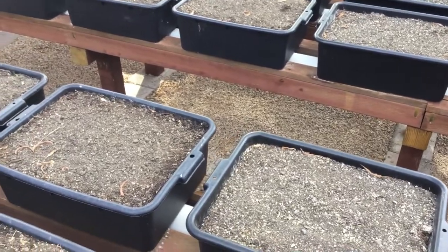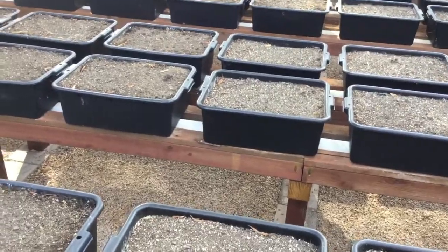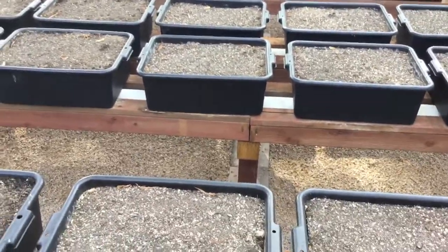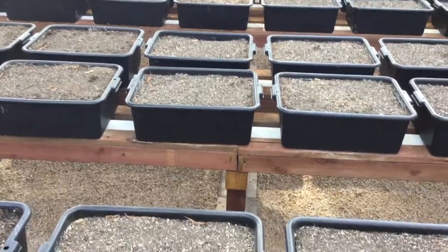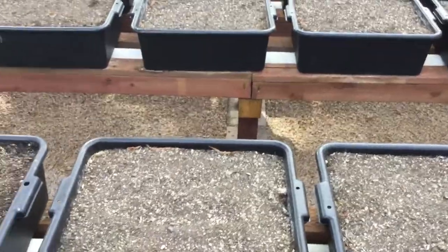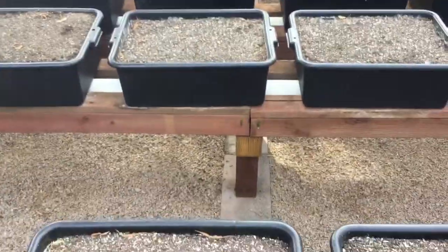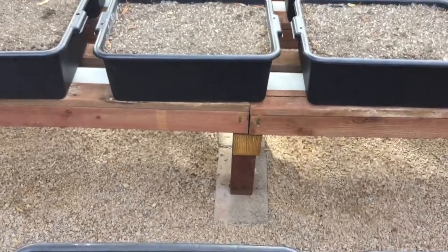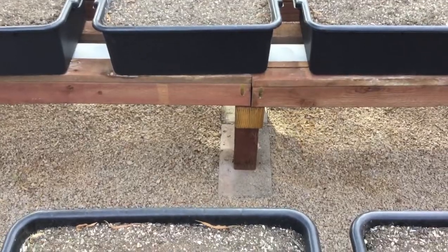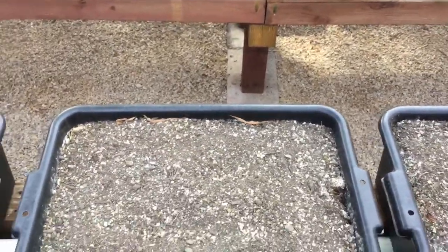We're finding out which plants we can grow in this area in the heat. We tried building 15-foot-long supports by staggering and splicing them together, but they're just heavy and warped. So we went to eight-footers, cut off six inches, and put them right over the support beam and screwed them in so they're all very solid.